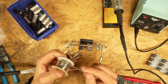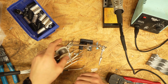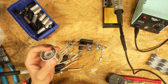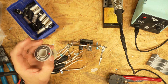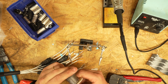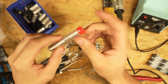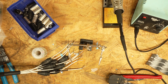Forgot to mention, you obviously need solder in order to solder. So, duh. This is 60/40 rosin core solder. This is what I prefer. I typically stay away from the hobbyist lead-free stuff. The stuff with lead works a lot better. It's easier to work with, although it does contain lead. But you can also get this silver bearing solder. This is pretty expensive. It works well for small circuit boards and stuff. 60/40 will get you through most projects, especially cables.